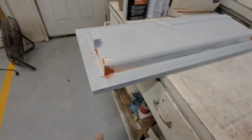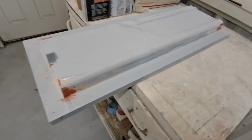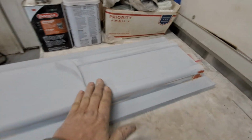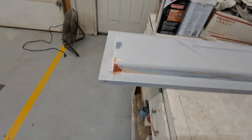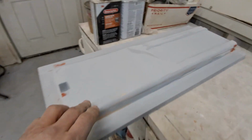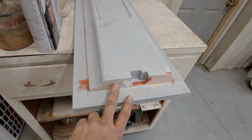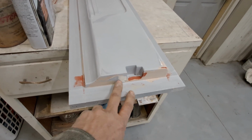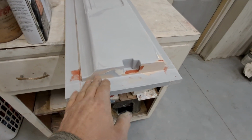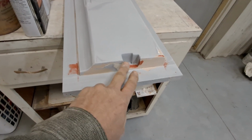I just put the lacquer based heavy primer, spot putty, I guess, on it. This all stayed good. This is ready to receive 600, but now I will have to coat it again, probably with surfacer though, so that I can block it down, because you got different material. You got plaster, you got primers, and a crack that I cut out. I just took a razor knife and cut the cracks out until I could get back to where it wouldn't blow off with the blowgun.